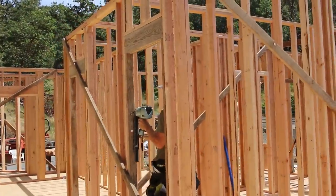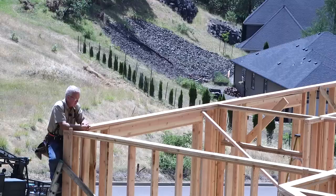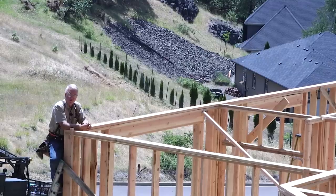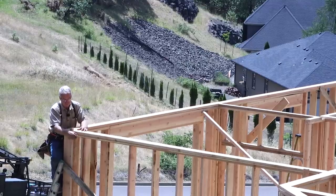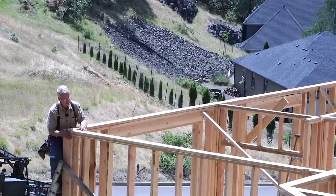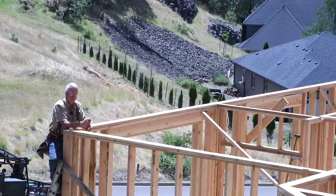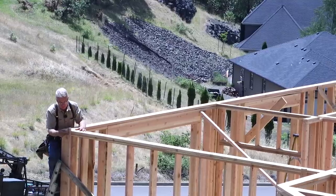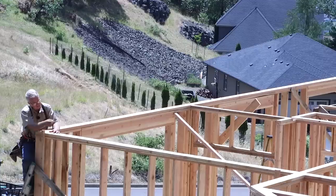I have really good confidence now that these walls are square and that the corners are plumb. The only thing remaining is to make sure they're true or straight. So I've stretched strings spaced 1.5 inches off of the outside of the wall, all the way around the perimeter, or at least on the long walls. And since I know that it's 1.5 inches away from the framing on both ends,